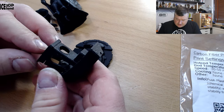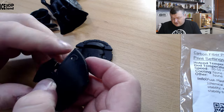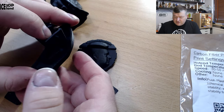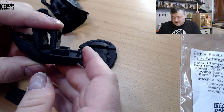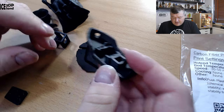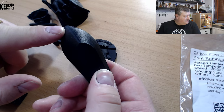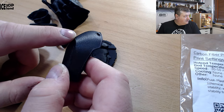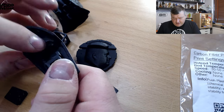I don't know — I was printing at 260°C, in the middle of the given temperature setting, and I was having issues because on my printer maybe I needed to have it in an enclosure. I don't know what needs to be done for better layer adhesion. I have to experiment more; maybe it's my environment or my settings, but print quality was looking really nice with no cooling — a great matte finish — but layer adhesion was a problem for me with this filament.